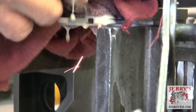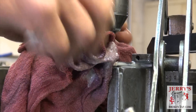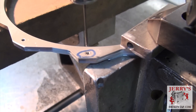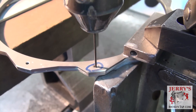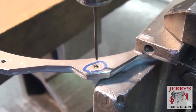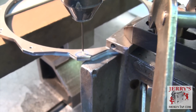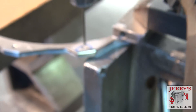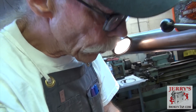I won't go all the way through so I'll show you exactly what's taking place. I take a second look to make sure that I'm on center. We haven't burned through the tap yet — you can just see that the electrode has penetrated that far. So we have started our hole through the tap. I double check my center to make sure that I'm on the center of the tap.